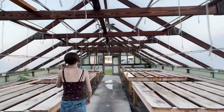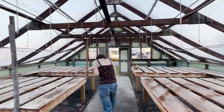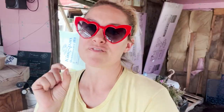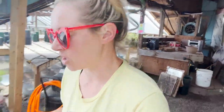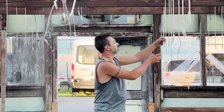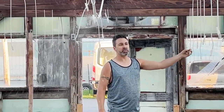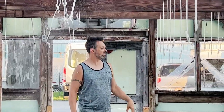We even turned on the drip irrigation system to see what was working and what wasn't. The drip system is in greenhouses one and three, and I'd say about 50 percent of the drip lines had frozen with water in them because they were never drained at the end of the season. They were cracked and you could see specifically where they cracked. Even one broke off in Brad's hand — it was just so brittle from the weather and not being used for years. The irrigation system definitely has to be replaced.